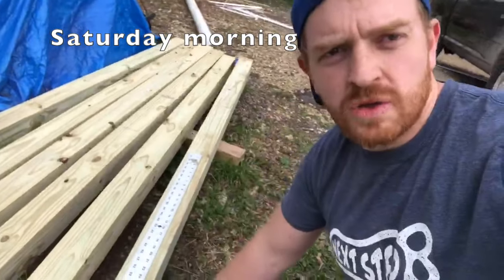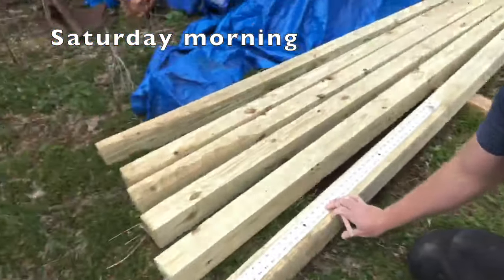I'm hoping that this weekend I can build most of the chicken coop structure and get those chicks out of the house. Mark two feet up on each one of these posts. I'm going to notch them out for the 2x6 frame around the hole.